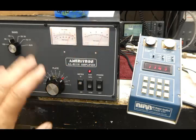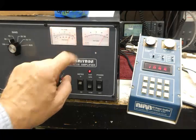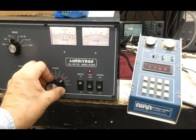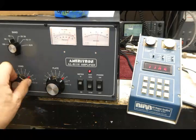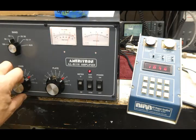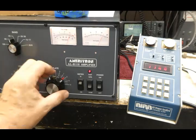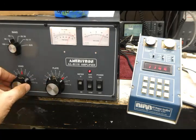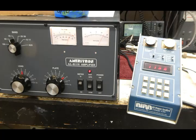About 170 milliamps. I set it right below the red. If it's flashing red, the output is down just slightly. And if I go the other way and load it too heavy to bring the grid current down, the output isn't dropping too much, but the efficiency is falling apart. So for maximum efficiency and good linearity, get right up around 160 to 180 milliamps, right when the meters just start to pulse red. That's all there is to tuning this thing up.